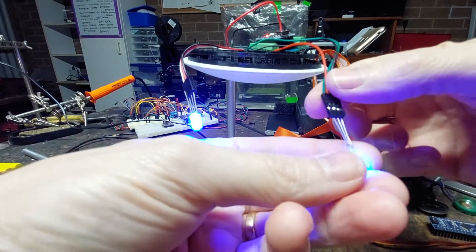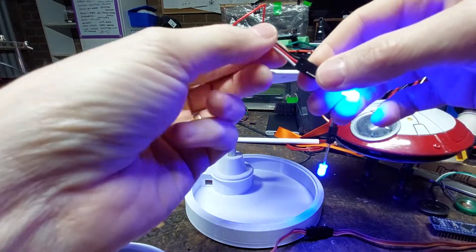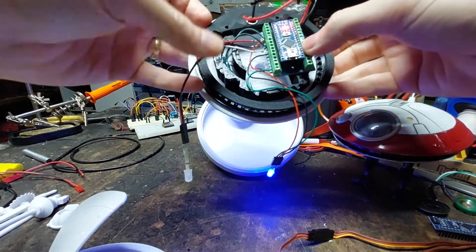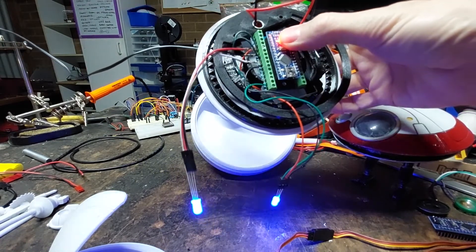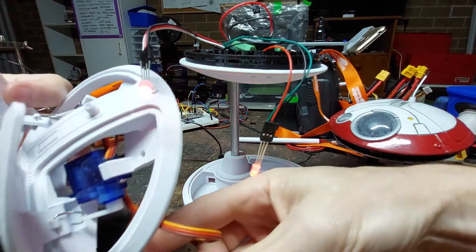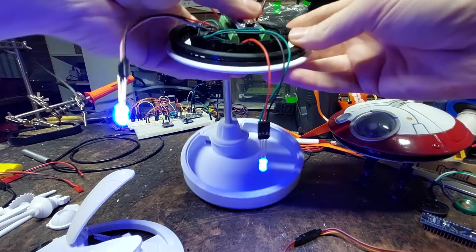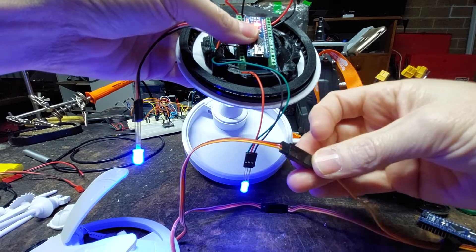Simple things — these are just the RGB LEDs. What I have here is just servo extension cables, some old ones I had off a 3D printer, but you can just use a standard servo extension cable. You would have to put some kind of tape, hot glue, or heat shrink. The idea is that there's enough room in the body that you could push all that down inside the cavity, power up through the tube into the body. The servos will come from 5V and ground, with the signal to pins 9 and 10. The 5V and ground come off the Arduino's built-in regulator — so I have 9V coming into the Arduino on the V-in and ground, and then 5V coming out and ground going into the servos.